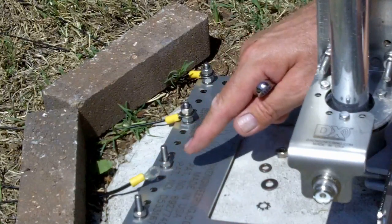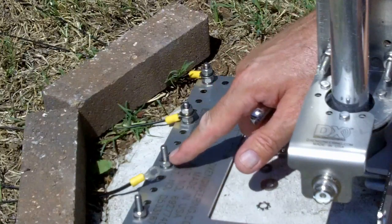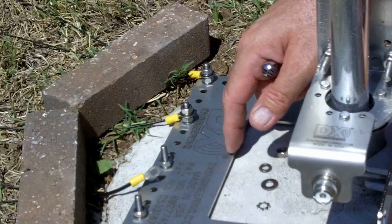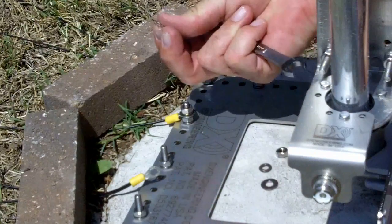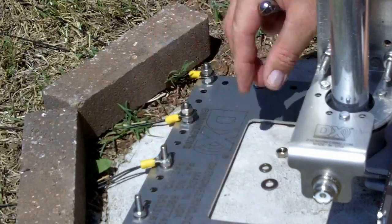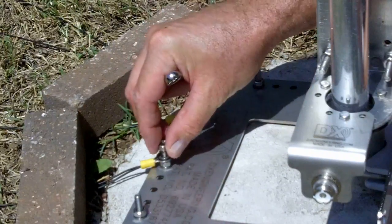I had to buy a little bit of extra hardware — not too much, just a few bucks — and I'm going to attach them a little bit differently because I wanted to have easy access to taking them off, especially if I need to replace them if I run over them with the lawnmower or whatever. It's very simple to attach them: star washer first, then the solder lug, just pull it right over, flat washer, split washer, and a nut.